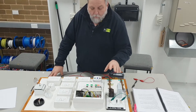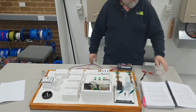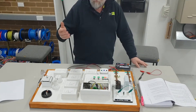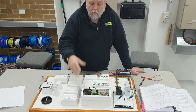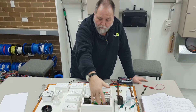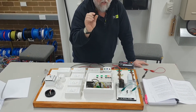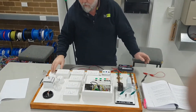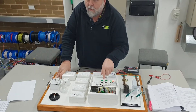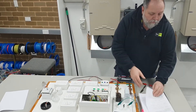So we've covered polarity. The next tests include fault loop impedance. The fault loop impedance test is about everything from here back in the loop - from the neutral bar going back to the centre point and back to the top of the main switch. On large cables the resistance is very small, but the concern is: if there's a fault or short on any appliance, is the resistance of the earth and active low enough to allow fault current to flow very quickly?